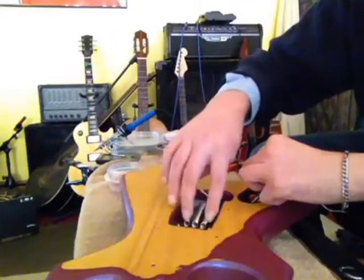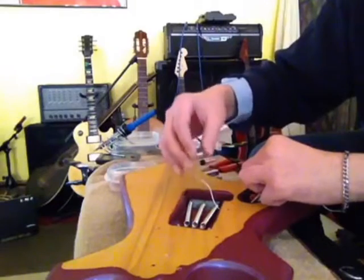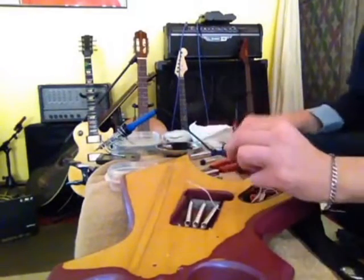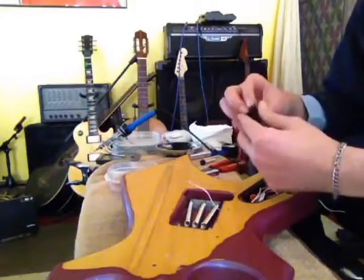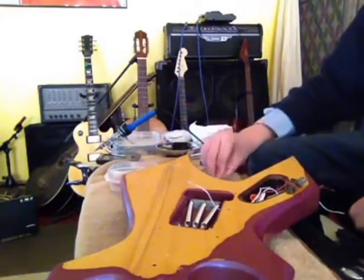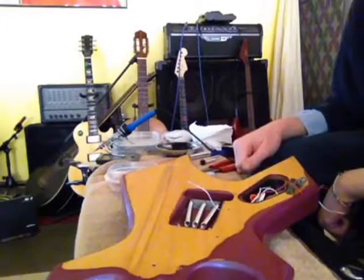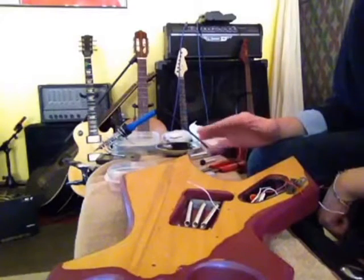the claw, but also the springs going to the tremolo block, going to the strings. Everything's going to be grounded so that you're not going to fall into any problems if you're holding the microphone or anything, you know. And we also got our input jack that we're going to solder in now that everything is back together. And then I'll show you how to check to make sure that everything is uniformly grounded, okay?